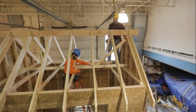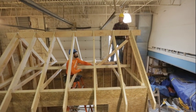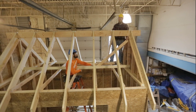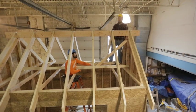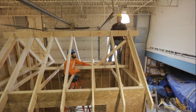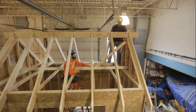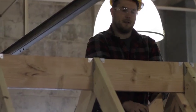The reason we're doing this is that without it, our roof actually deflects side to side a little bit — and it would be a lot greater if we had a bigger roof with longer rafters. This really stiffens up the roof, so any wind that blows on the gable ends won't shake the roof once this brace is in place.